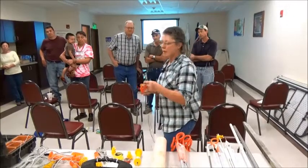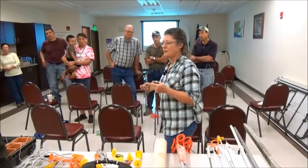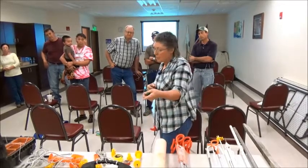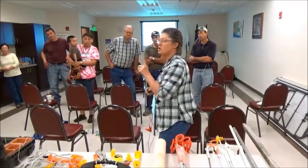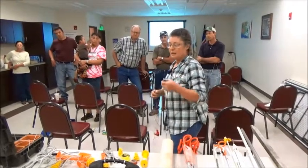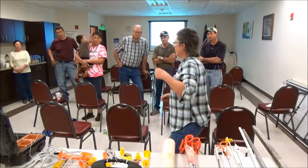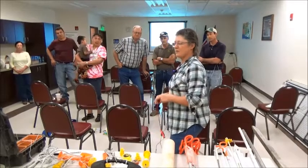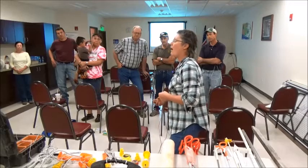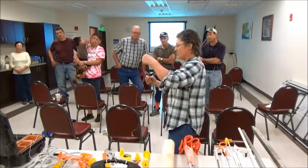And then you go, oh, well, I'll just tie the wire together and it'll be fine. Except that the wire will get separated and then your charger will look like it's working. You won't have your tester because you never carry it no matter how many times I tell you. And then you'll have no fence. You'll have miles and miles of stuff out there for things to get tangled up in because what's your number one rule? Hot. This is critical.